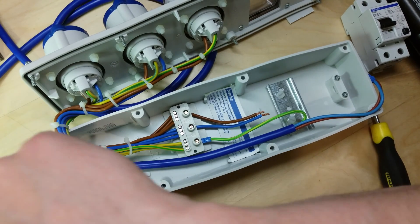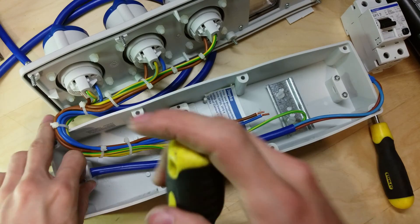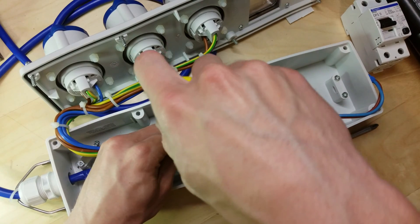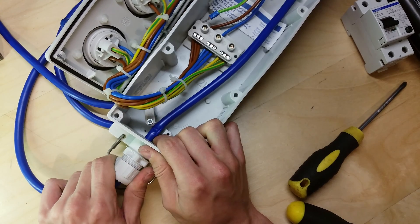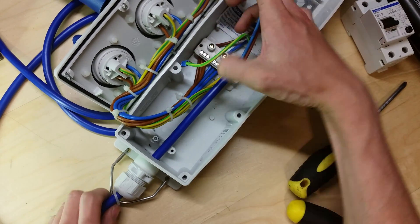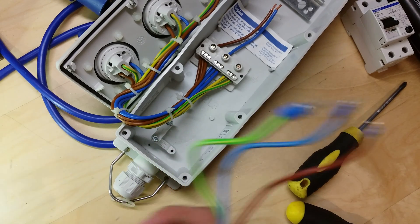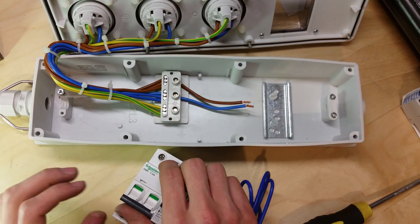This enclosure is actually quite flexible — it seems to be a generic one they use for pretty much any distro they're making. These units are quite expensive to buy; I only paid £20 for this one but everywhere else they're around £120 plus, so I got a really good deal. Now the grip's removed, I'm going to undo the earthing connection, then undo this gland here which seals the cable entry — it's very stiff. Now the cable can slide out. There we are — the incoming tail is now removed.